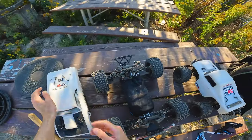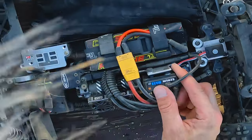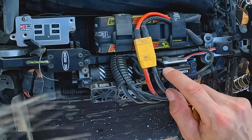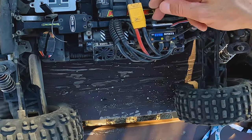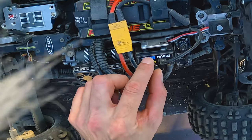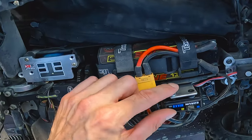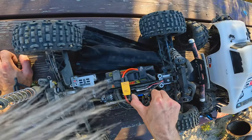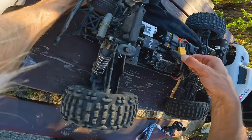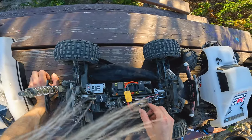All right, let's see how my mounting setup worked out. Oh, that's so sad. So this thing has these mounting holes. They're pretty small, they're for little M3 screws. So I made them a little bigger so that I could fit M4s, but I kind of messed it up because I don't have a good blind tap. So I had to make it even bigger. So now I got this giant one on there. Ugh. But stayed really solid, no troubles there. It got to full temperature. I took some good hits with it and well, obviously broke something. So I'm gonna call this a big old win.